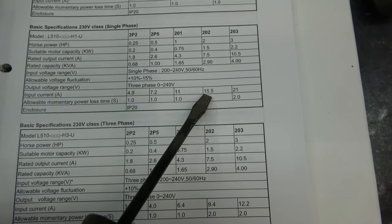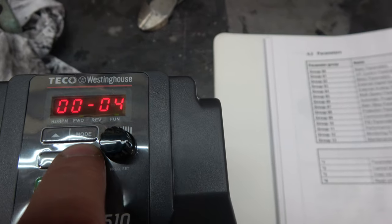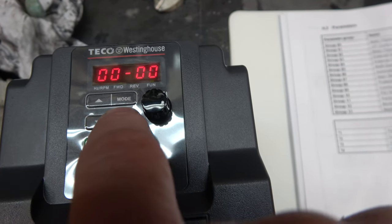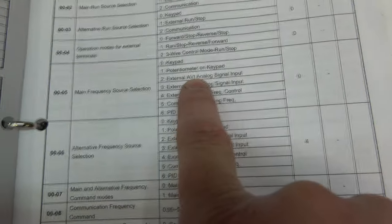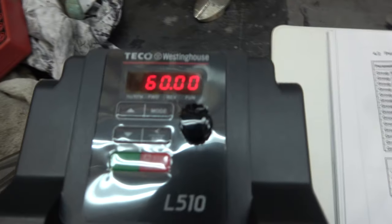So I think I'm going to fuse this at 20 and have a 20-amp breaker for it. For control method, I'm going to pick SLV mode — that's code 00. I changed code 5 to the potentiometer on the keypad. Now that works, but it's just going to be left at 60 — I don't have a frequency-drive-friendly motor, so I'm going to vary the speed with the actual mill itself.